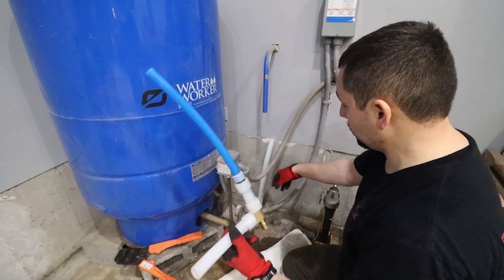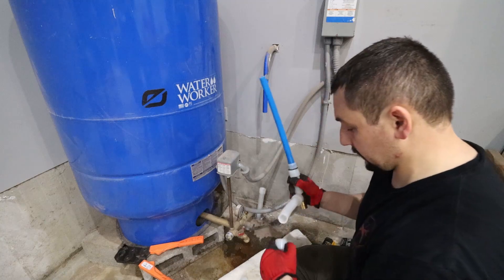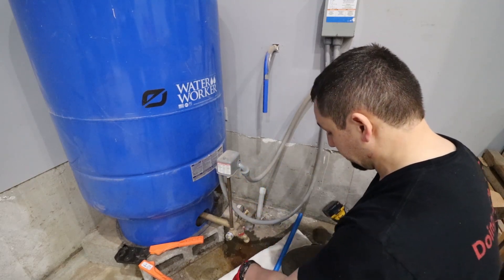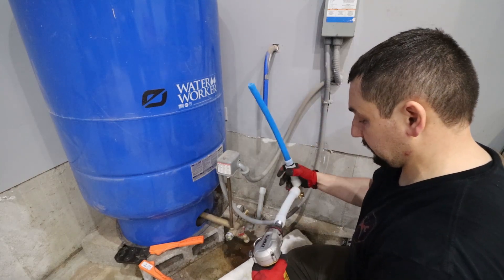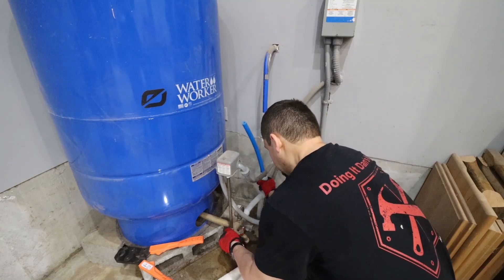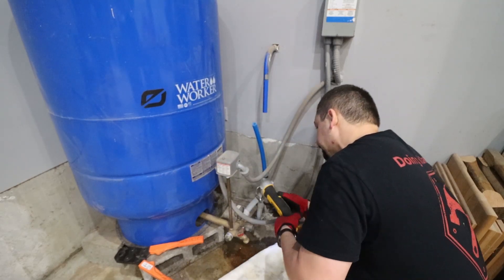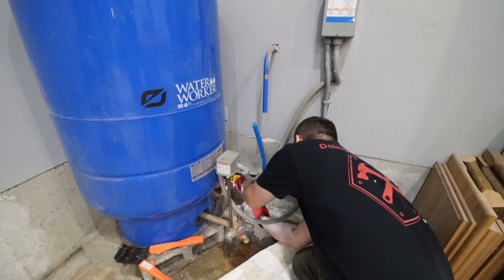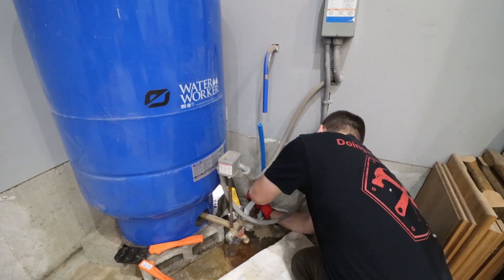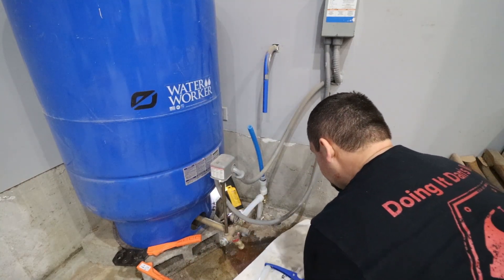I've gone ahead and pre-built the assembly we need. This is our one-inch line coming in from the well. We throw an expansion ring on this side and also on the other side. Because I have a little bit of play up and down, I'll make this other joint up first. We tried to seat it but were fighting it too much, so I pulled it back out to re-expand the fitting and get it seated properly.